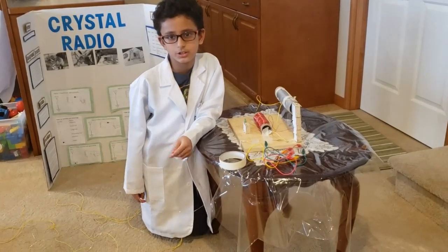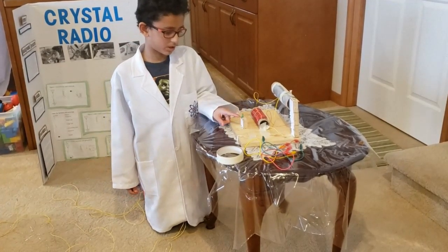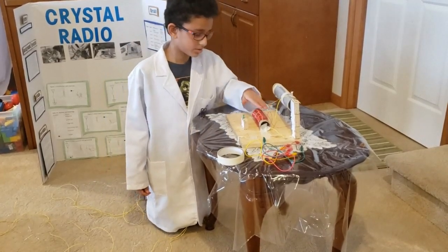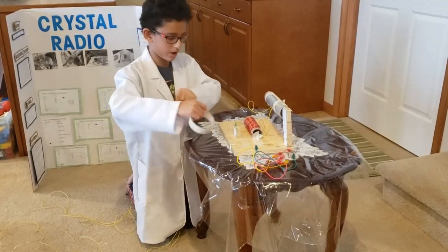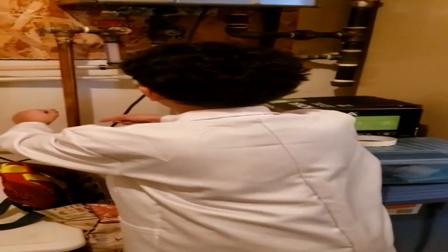Now we're on to the last part of the procedure: connecting. So far we just have this capacitor and this coil. The first thing you're going to make is this tuner. All you need is this paper clip — you're going to bend it out and make a loop here so you can pin it here. This is going to be what's touching the coil. Put it on a wood block and mount it about four centimeters away. Then on the coil, sand the top of it with sandpaper. Now you have to take the grounding wire — this is tin copper-coated wire. Now we're in the furnace room and we have this copper pipe. If you don't have one of these, you can just put a one-meter stick into the ground, or you could use a fence. So we're going to take our grounding wire and knot it.